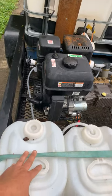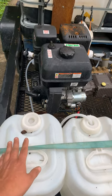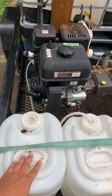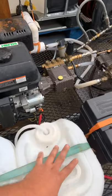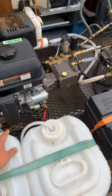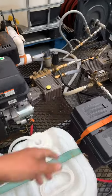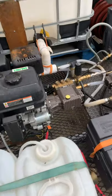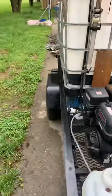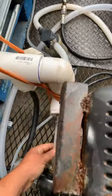I've got my gas can. These are five-gallon buckets — one I put my SH and surfactant in and then it siphons into the system. This one I keep fresh water in, so when I'm done at a job site or done for the day, I switch it over to here with my j-rod. I keep my soap tip on, draw it up, and flush out my system. It keeps the lines flushed and makes them last a little bit longer. I have a water feed coming out of this on three-quarter-inch lines.